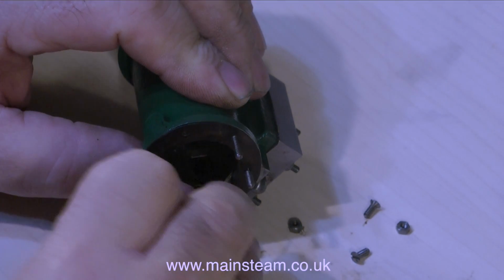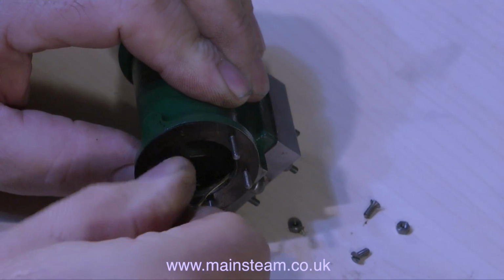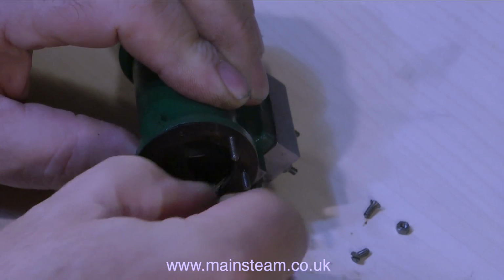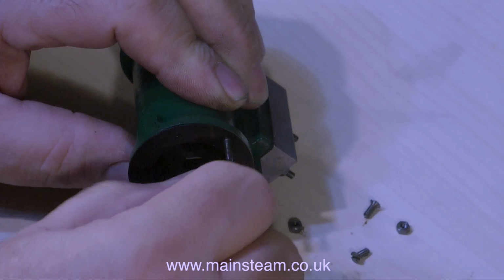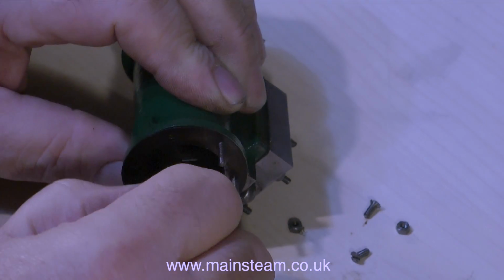And it only applies to cylinders that have the steam ports and steamways cast in. And having the steamways cast in I find to be a real bonus because you do not have to drill the cylinder down to the steam ports, which can be a very scary job if the drill bursts through the port face instead of into the port itself.